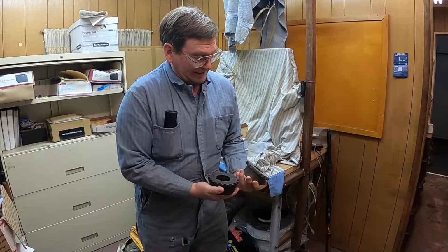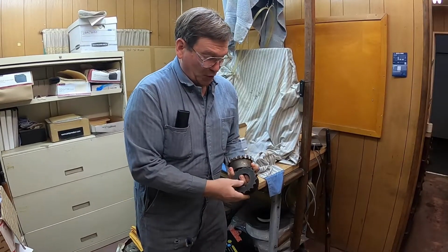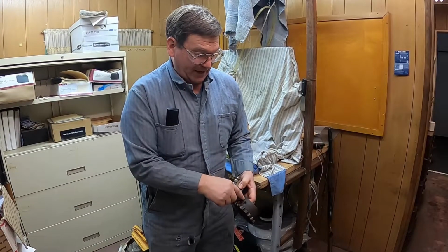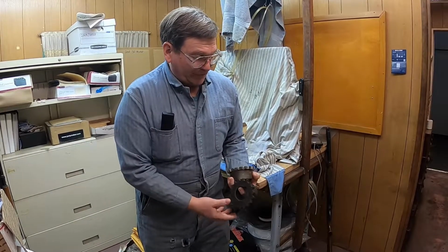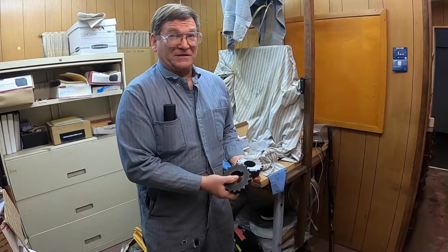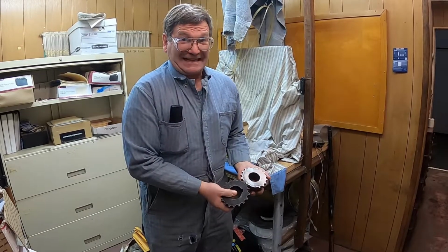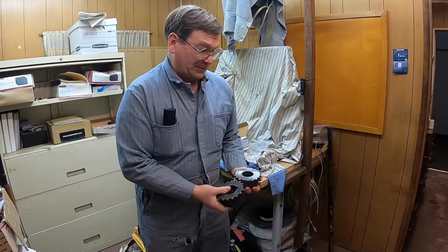The other thing, since these have obviously had extreme torque put on them, more so than in most applications, even though this isn't right away, but we have this split through the key and the teeth torn off. There may have been lots of reasons for that, but they're going to put this back in operation with the same components, all the rest of it. And I don't want this to be the part that fails. So we'll be making it out of harder steel than what these are normally made out of, so that they have a little better quality component on top of that too.